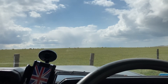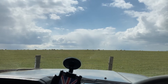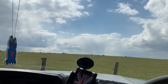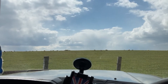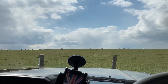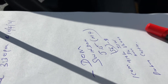So yeah, if you do want to get the 7900 you just need to get a big mag mount — it will work fine. You just need to remember that the 7900 is quite a large antenna, so you just have to watch for overhanging branches. Having spent a lot of time driving around with it on top, I know how to avoid the low hanging branches and stuff like that, just to make sure I don't damage the antenna.